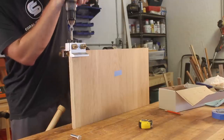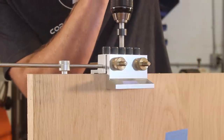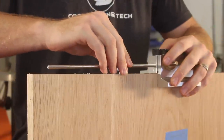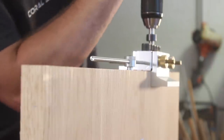The joinery for this table will primarily be dowels. I'm using the Dowel Max and 3/8 inch by 2 inch dowels. I decided to make the sides surround the top, which meant I could cut the top, bottom, and long divider to the same length. Because of that, I'm drilling into the end grain of the long panels, and then I'll cut into the face grain of the sides.